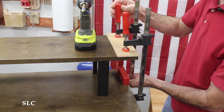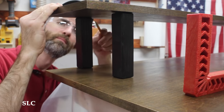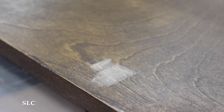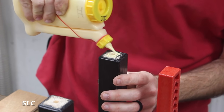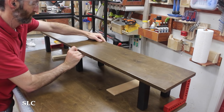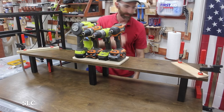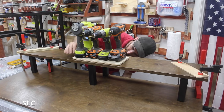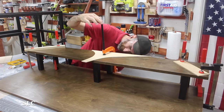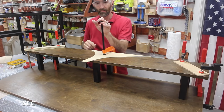I realized I needed to glue the pedestals in place to keep anything from pulling out in case the wood starts to warp. So I gently clamped down one side to keep it from moving while I traced out the position of each pedestal on the bottom side of the shelf. I then flipped over the shelf and carefully sanded out each of the positions so the glue would adhere to the wood. I added some glue around each one and laid the shelf back into position, clamping it securely on both ends. There was a slight gap in the center, so I looked around my shop and found a large C-clamp that barely fit but provided the perfect reach.